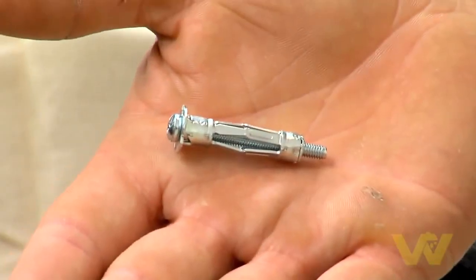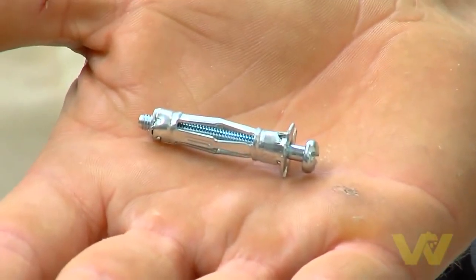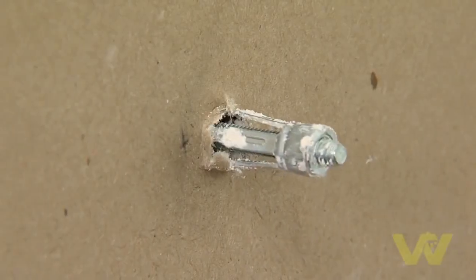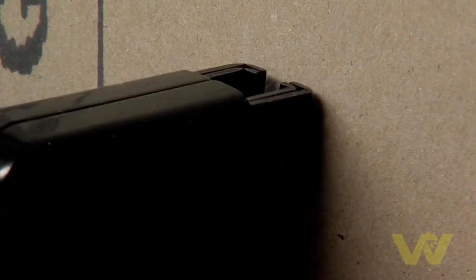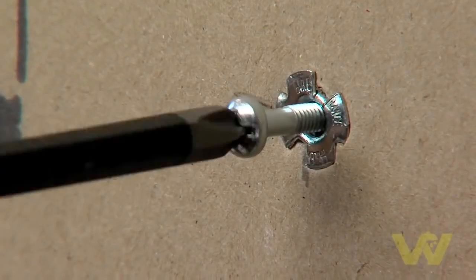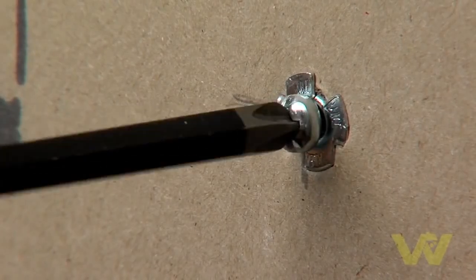This is an intercept fixing and it usually comes with a clamping gun. It can be used on its own but the clamping gun makes it very easy for plasterboard walls. Use the drill bit size indicated on the packet to drill your hole, place your anchor into the hole, and the clamp quickly locks the fixing in place — then tighten the screw. This fixing will create a good firm anchor to any plasterboard wall.